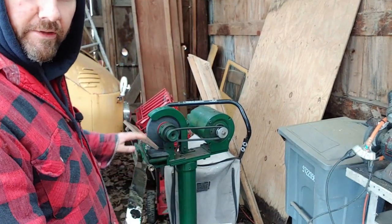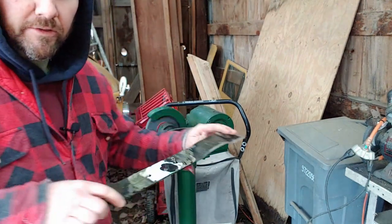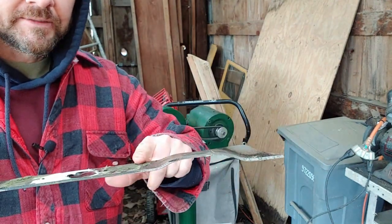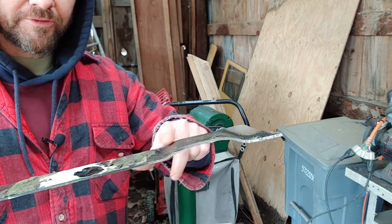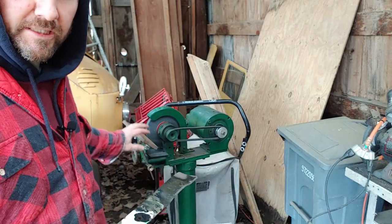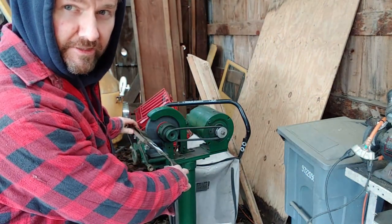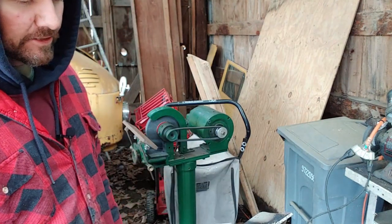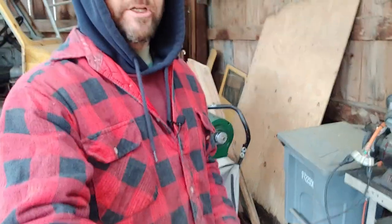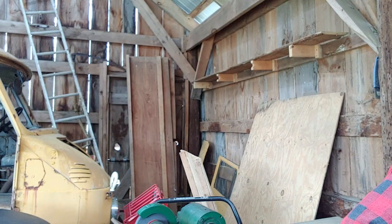The problem is that, with blades like this high-lift style, they're not the same — you can see how it comes up here. There's still a lot more for me to learn about mower blades, but what's nice about the flat-bed style is you get to maintain that bevel angle. With the high-lift blade you can't do it — you'd have to freehand. Magnematic does sell a model that can do high-lift blades, though their stuff is expensive, which is maybe why I'm enamored by it. I think the first place I would start would be replacing this balancing tool.